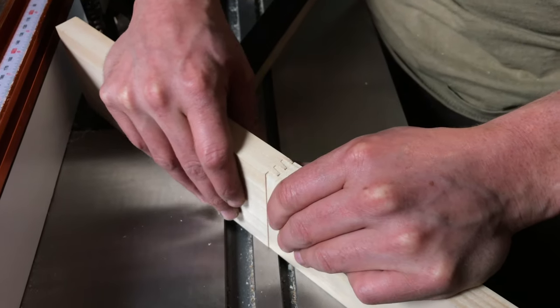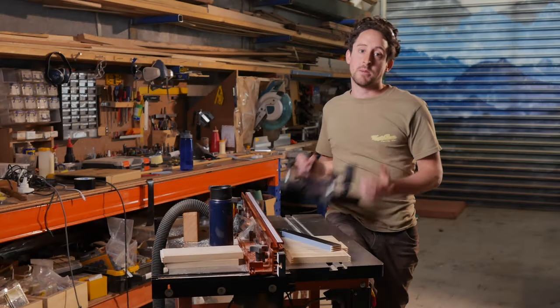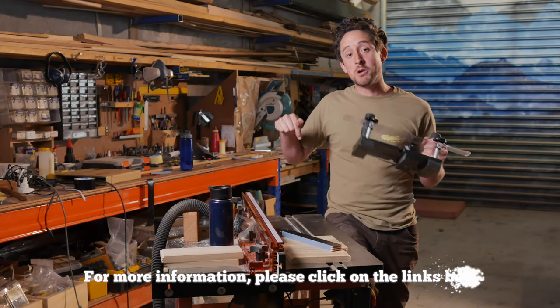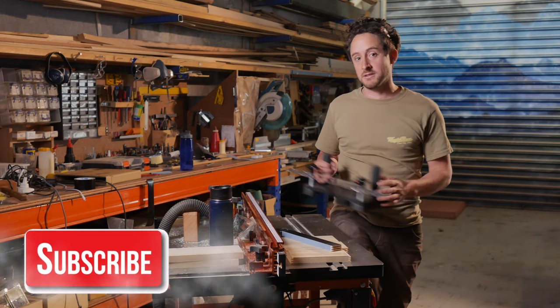As with most things in woodworking, there are a million ways to do end grain cuts, but a coping sled makes it safe, repeatable, and fairly accurate. If you've got a whole bunch to do, something like this keeps your fingers away from the blade and you can run pieces through over and over without worrying about kickback or things moving around. There's more information on this below — don't forget to like and subscribe, and head over to Timbercon to check out this and other cool stuff.